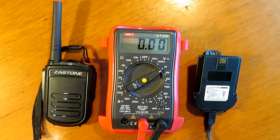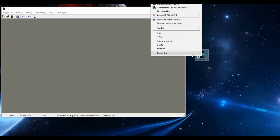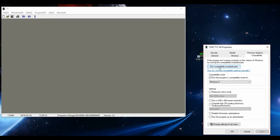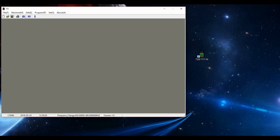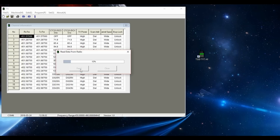So back to the software programming of this radio. One thing I had to do was put the software into compatibility mode. I'll put a link in the description where you can get the software, but if you set it up to run in compatibility mode you'll be okay — I couldn't see the ports until I did that. Anyway, I set it to English and did a read from the radio and it was absolutely fine.